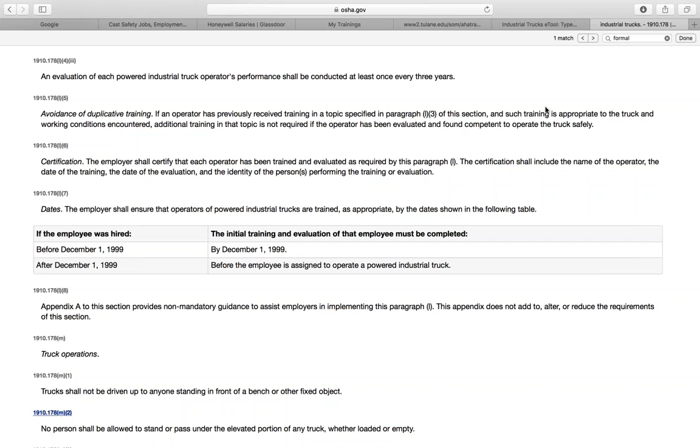We also want to recognize factors, moving on to page 14, folks, that can help reduce the capacity. So safe working loads, what are we talking about? It's basically the conditions we need to stay under so that we can maintain safe working conditions. And we have to remember that the safe working load of hoisting equipment is applicable only to freely suspended loads and plumb hoist lines.